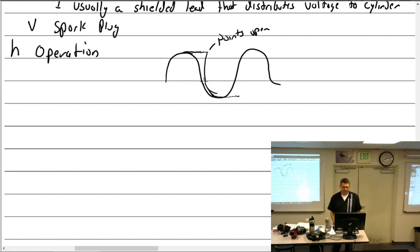And that's really where this little drawing comes in. As the static flux curve wants to die, we have a magnetic field that is already built up within the primary. So as it's trying to die, that magnetic field is saying, hey, you can't go anywhere, you gotta stay. We like it here. It's built up its own magnetic field that opposes the dying off of the static flux curve. So it holds it out. In the same way as it wants to build up, it opposes the buildup. No, we don't want to build up. But yet it will eventually. And the same is true when it collapses. Nah, we don't want to collapse. That's why we have to wait a little while. So it kind of comes out. And that also helps it to work, because you have this period between here and here. And as your book says, it creates this stress in the system.